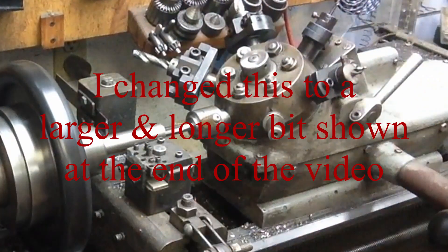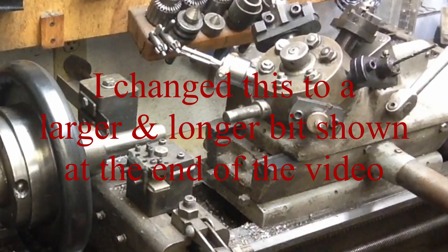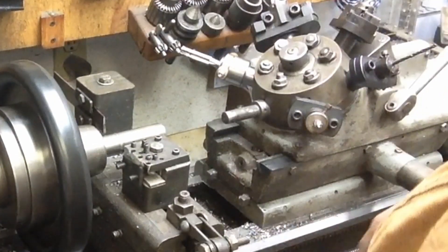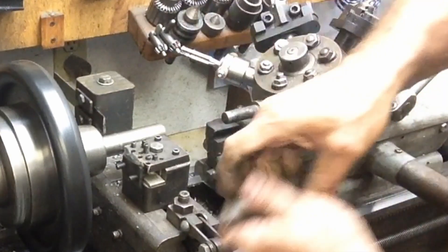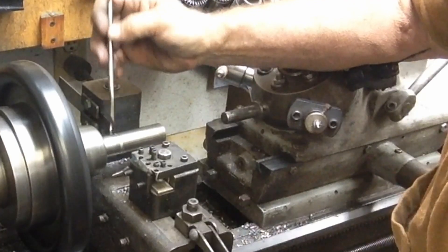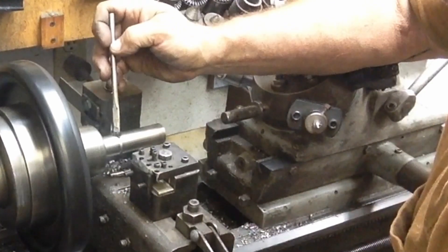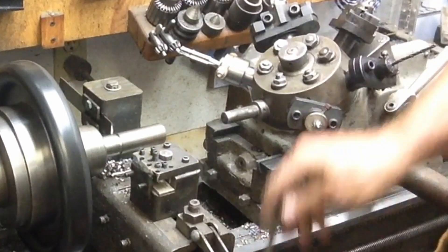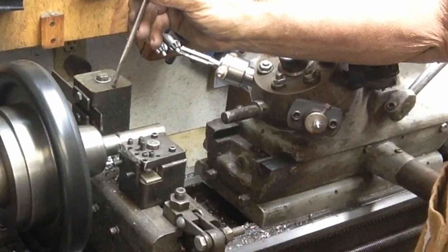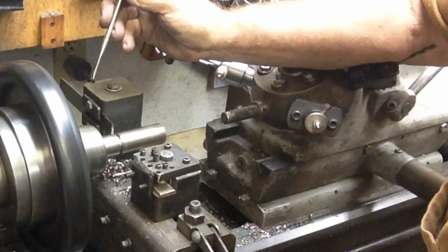The third position is just a small drill to get a hole down through it — I believe it's about an eighth inch drill. It's in a homemade adjustable style tool holder bored just for that drill size. This is only the first operation on this material, and any inaccuracies are fine as long as the internal bore and exit hole is aligned with the threads — everything else gets machined later and is not important. You only have to be as accurate as necessary to get the job done properly. These blanks will all be re-machined again and there's no problem with concentricity. This is a perfectly satisfactory setup for that — it's just not very efficient.